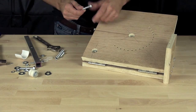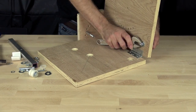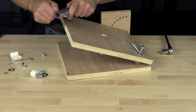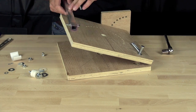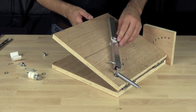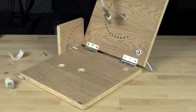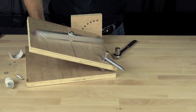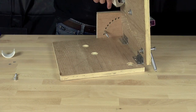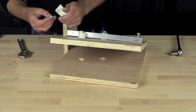Now we're going to assemble all the different components — inserting washers, then nuts on top, and lock washers and nuts on the bottom for the bolt holding the spring in. Now we're going to put our eye screw in and then insert the center pivot screw. That's got two nylon washers, then two washers, two nuts, and a lock washer on it so we can tighten it down. That holds the bolt in place but still allows the aluminum to spin freely. Now we're going to put our stop in place — another 5/16 bolt with some nylon washers around it.